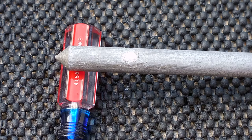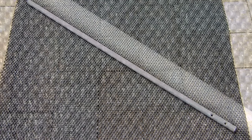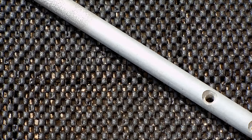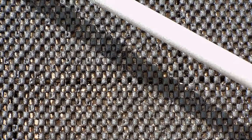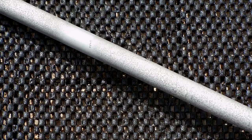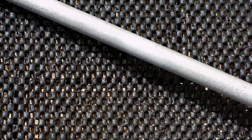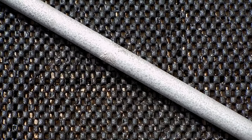Three full days has now passed since I applied the gallium to the aluminum rod. The corrosion pretty much stayed about the same — it did extend a little further this way, ending right there. So over here is strong aluminum, and over here is where the aluminum has been affected by the gallium. At the center, there's now just a small space of about five-eighths of an inch between the single drop of gallium and where I put the gallium around the entire center, and as you can see, all the way around is corroded.